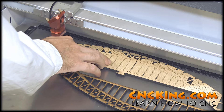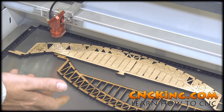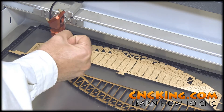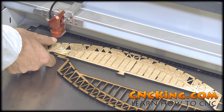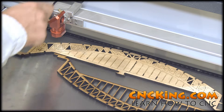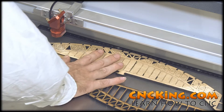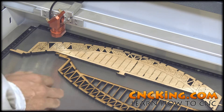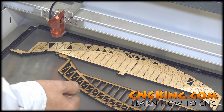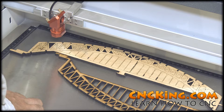What I want you to notice is the inside — it's a sharp 90 degree angle. That's something that's not possible with a router because you have a round bit. The other thing here is the infinitely small line width; this is the amount of material removed when you do laser cutting. With a CNC router, you have a much larger bit, so more material is removed. Also the lens is not actually touching the material, it's just a beam of light. As a result, you don't have anything pushing, pulling, or tearing into the material itself, so hold-down — you don't need any. All you need to do is slide in the sheet and cut away or engrave.